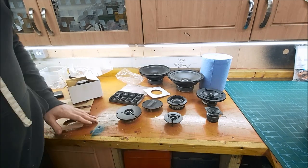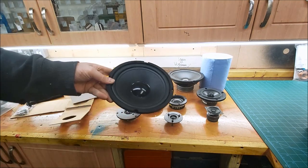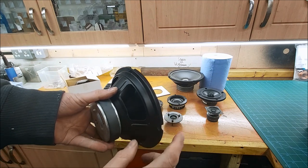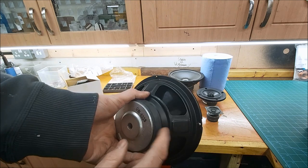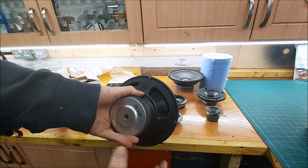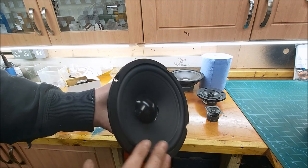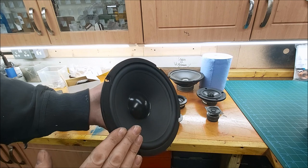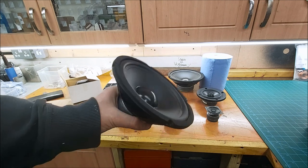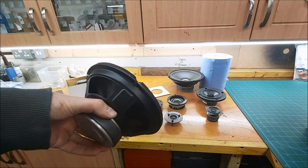These are some of the drivers I've pulled out that I've shortlisted. This woofer is exactly the same size and will fit exactly the same cutout as we've got. Polypropylene, nice big motor structure - I think it might be QTX. But I don't think I'd really want to be using it much higher than 800 hertz, maybe a kilo hertz. So this is going to be a bass driver - I'm not going to get this to do mid range as well. That straight away pushes us into a three-way design.